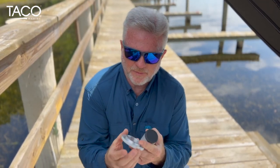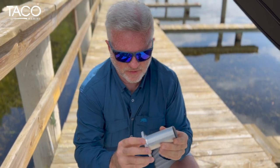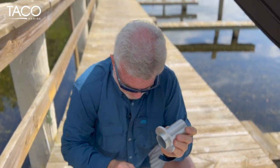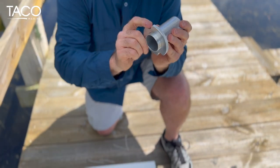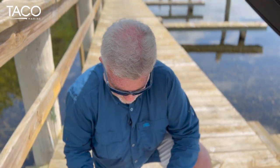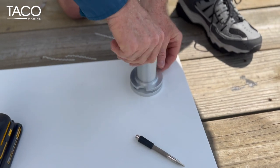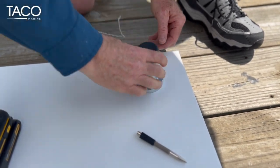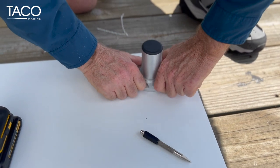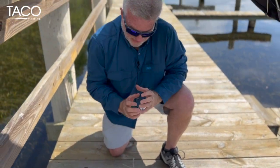Now the next step is to take this slotted piece with the lip on the upside toward the top of the actual post, and screw it on all the way until it stops. This threaded piece is going to go into that base, and then we're going to tighten the flange down tight so that the Shade Thin Mini mounting system will sit right on it and be a good application. Give it a good torque, make sure it's in good position, screwed down really nice and tight. At this point, the Shade Thin Mini mounting base will go right on to this post.